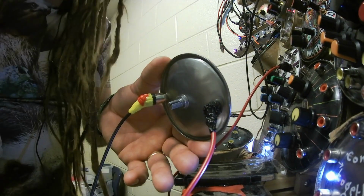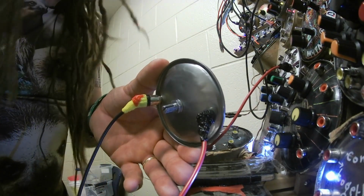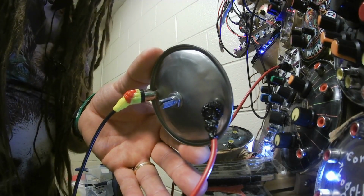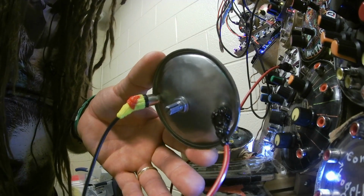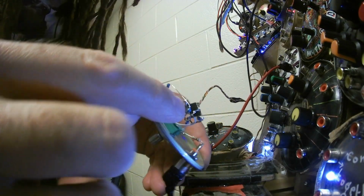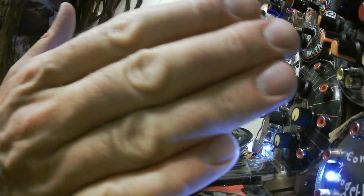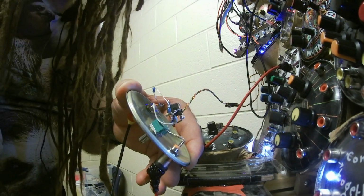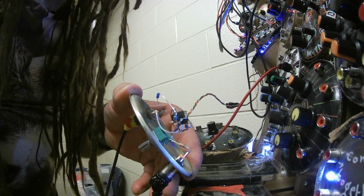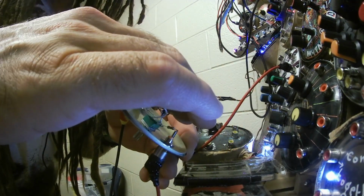Maybe there's a lot of noise because it's a high gain circuit. You can hear that noise coming from the rest of my synth. The 100 gain circuit right there in this op amp, that's going to be picking up noise, especially since nothing in here is enclosed in any kind of shielded enclosure. Like, listen to this. It's not too bad. I thought it would be worse.